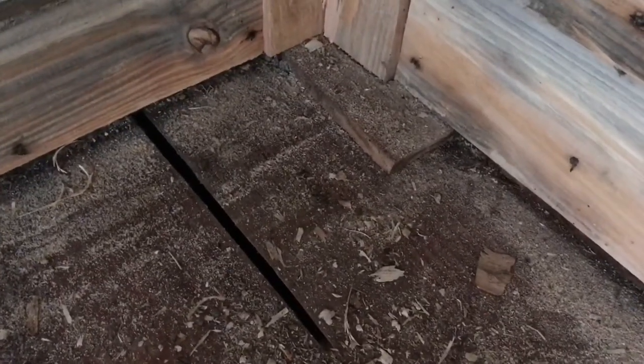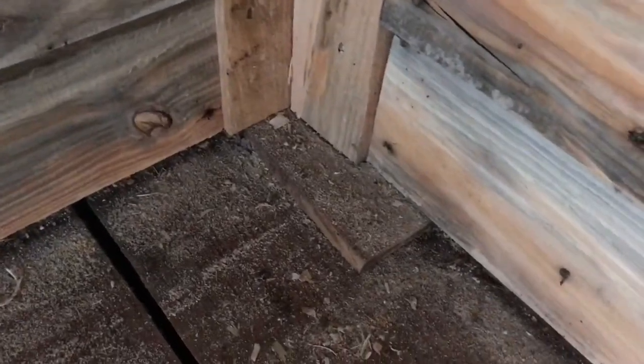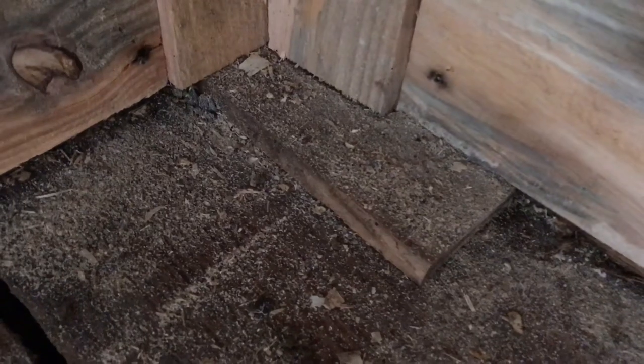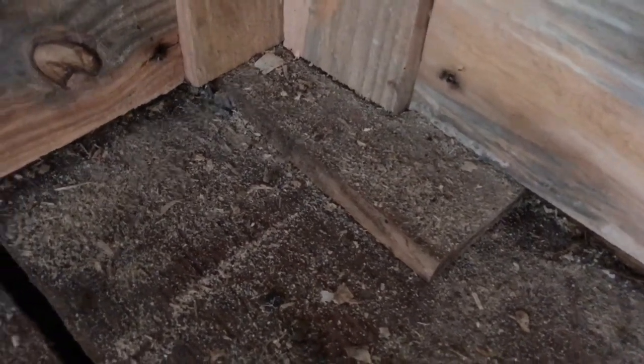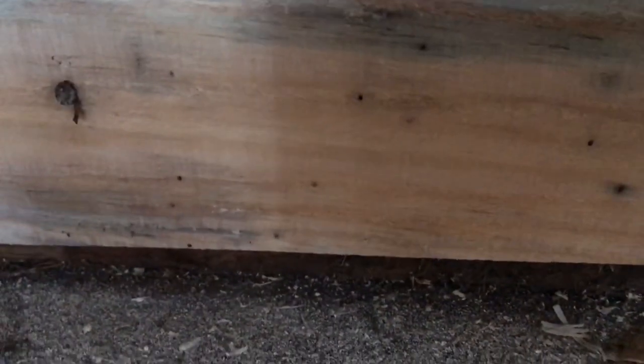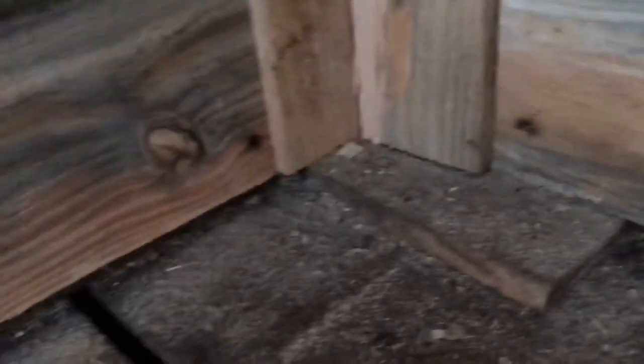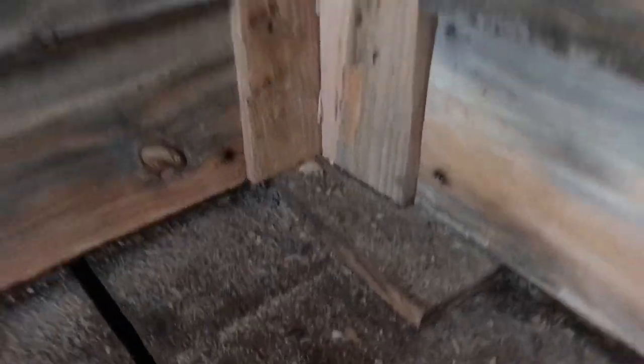And then on the bottom corners, when it's all said and done, we intend to put down 1/2-inch treated plywood as a smooth floor because of all these gaps that opened up again with the green lumber. So we're going to put in pressure treated plywood. We put a little 5/8-inch block underneath here for now just to hold everything up, to make sure that one's actually stuck. I've got to hammer it out, but the other one's all pulled out. But anyway, just a little spacer block. So you can see there's a gap under the edge for right now, but that'll let us slip our plywood up underneath the siding, so to speak, the wall board. So it'll be a nice flush look when it's all said and done.